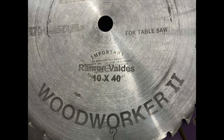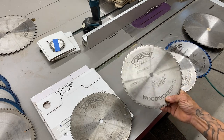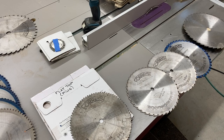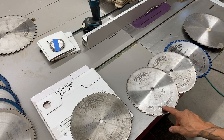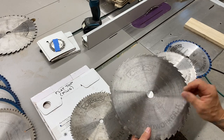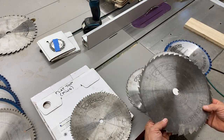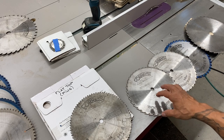Speaking of Forrest, this is my favorite blade — this is what I use almost exclusively on my 10-inch table saw. There's another one on there now, but it's the Woodworker II. Really awesome blade all around. You can make super clean cuts in plywood, melamine — it's actually designed as a rip blade, but it handles everything. These are 40-tooth. This is my go-to blade for just about anything, unless I'm cutting particle board or MDF. Here's another one — a Woodworker II but in 12-inch. This one is dull; might've got that at a yard sale. Love Forrest blades.